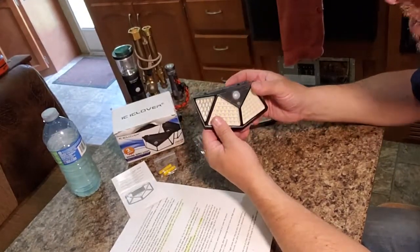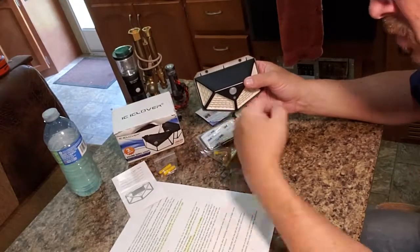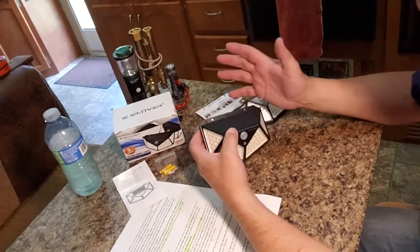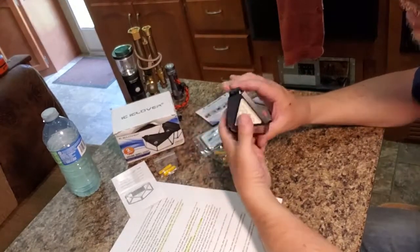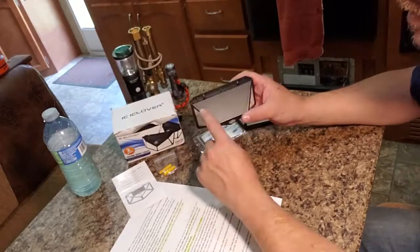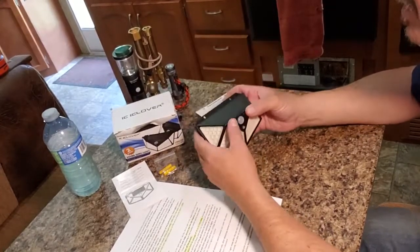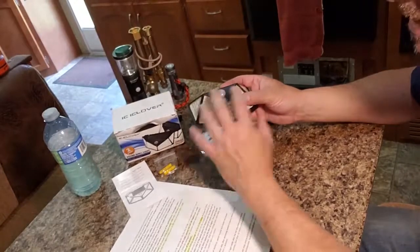One interesting thing I like about these is that they're the first ones I've ever tested that have a lithium-ion 18650 battery inside. Most of the ones I've bought usually have nickel cadmium or nickel metal hydride batteries in double-A or triple-A size for garden lights. These have a lithium-ion, which is interesting — I'm curious how that would work out in cold weather, since lithium-ion doesn't like to be charged when really cold. But the panel is small and only trickle charges at probably around 0.05 amps, roughly half a watt.